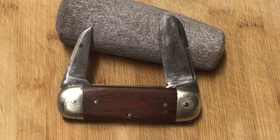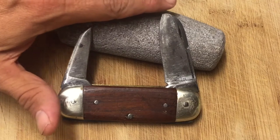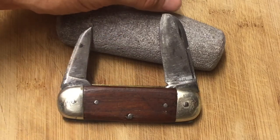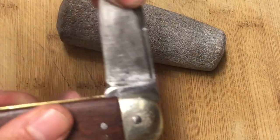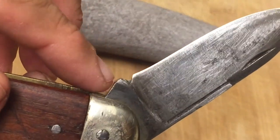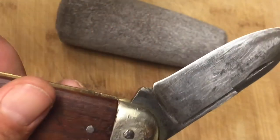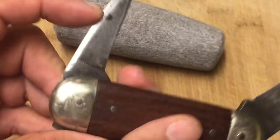We commented back and forth via email, and Stuart recommended that I do a vertical shave right there and kind of reconstitute that blade profile with a grinder. I had been toying with that idea too. I didn't really want to lose any of the blade, but I had already tried polishing the kick and taking a little bit off that way, which had no real effect. So I decided to just go ahead and try what Stuart recommended.